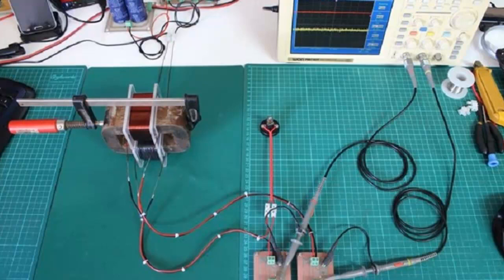We saw it by the torque on the rotor in the last demonstration. If the shaft torque on the rotor was sufficiently strong, then we could stall the petrol engine on the generator, and that would effectively switch the machine off. Stall the engine, there's nothing turning the shaft, so there's no output on the output terminals. Pretty straightforward. It's just a little bit of common sense. There's nothing hard to this.